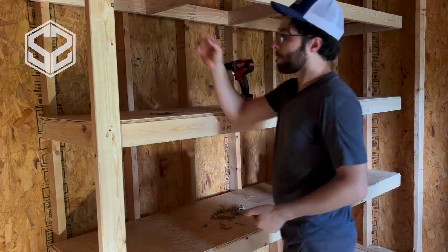For this next section, the frame is going to be built exactly the same, only shorter — four feet wide. I'm going to be building five of these instead of the three on the other side. This is going to be a lot closer together and will give me plenty of shelf space for smaller items. The top shelf I'm actually planning to have end at the same exact height as the other top shelf, so it's going to be one continuous top shelf across the top.